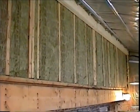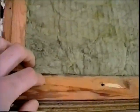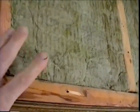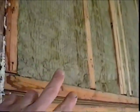The next biggest job was taking off all the siding here — I stripped that all off. When I stripped away all the siding and other layers and got to the insulation point, all there was was some older pink insulation from the 70s when the house was built, and it was starting to sag between the studs and wasn't adequate. So I stripped it out and ended up putting in Roxul for better soundproofing. I'm going to put resilient channeling on here as well, and probably end up doing the same layering technique with the materials on this portion too.